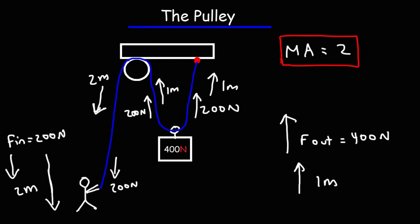If these two ropes go up by a total of 2 meters, then this rope has to go down by a total of 2 meters — they have to add up and be equal to each other. If these two ropes go up by 1 meter, that means the crate only moves up by 1 meter. So when a person pulls down the rope 2 meters, the crate goes up by 1 meter.